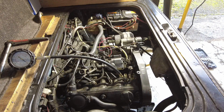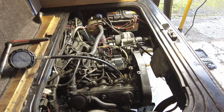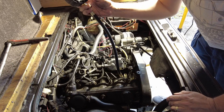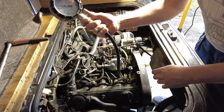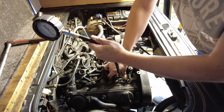So this is going to be the cold compression test — we'll be doing two. We'll do one when the engine's cold, and then we'll heat the engine up and do another one when it's hot. So I'm climbing into the van now, and you guys can keep an eye on the gauge. Number one — just shy of 400 psi, so that is not bad at all. 380 psi is what we're getting there. You can see why a petrol compression tester would just blow the bollocks out of it if you tried to use one for this.